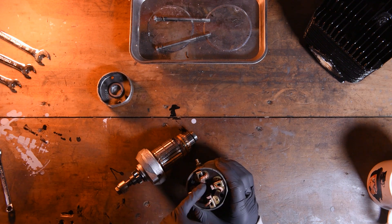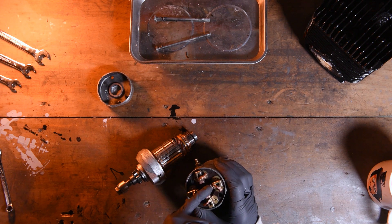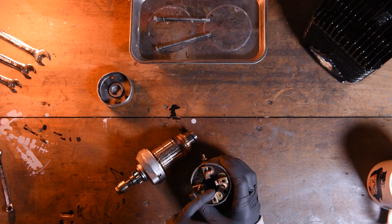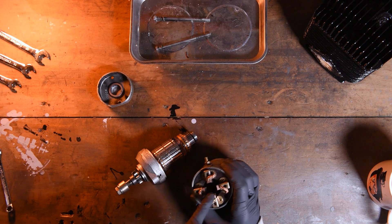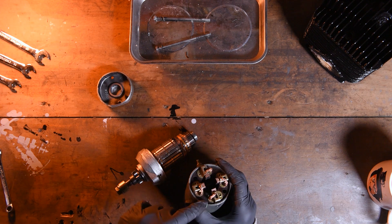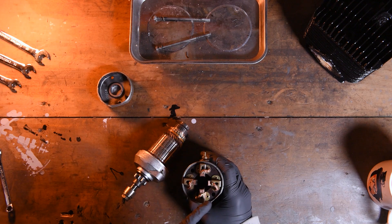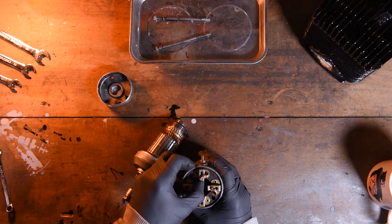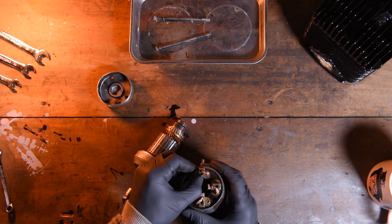For the most part on paramotors you'll probably find that these little pieces called your brushes are probably going to be alright. They're not getting as heavy use as a car or motorbike does, because let's face it most of us are taking our paramotors out on the weekend. If these brushes are worn down to a nub and fallen out of their cases you can replace them — you'll just need to snip off this copper wire and re-solder on a new brush. A crude way to check the life of these brushes if you don't have the specs is to push them back into the holder and look into the gap to see how far they've worn down.